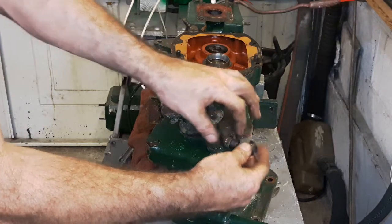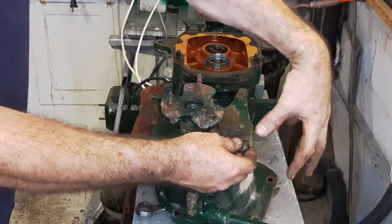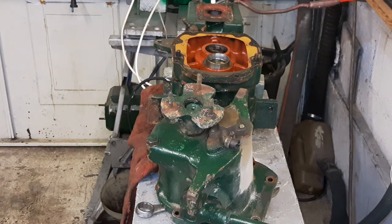This one's broken in two at the moment, but to get that rubber hose on an assembled exhaust is very difficult — I wouldn't try it. So make sure that hose is on first, then get the exhaust on loose, plug in both ends, and when you're happy, do up these four bolts. When you've got the gearbox together, there is another video which talks about setting up the Morse control — you want to make sure that the lever has a little bit of free play in forward gear so it doesn't burn out its interior roller, and that the neutral position is set right. Those are your main points for taking the gearbox off and putting it together safely. This is a Vire 7, and the same is true on the 6 and the 12 with differences on the exhaust. This is Nick from VireEngines.com.